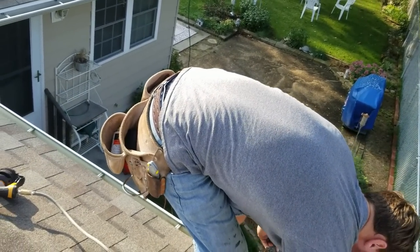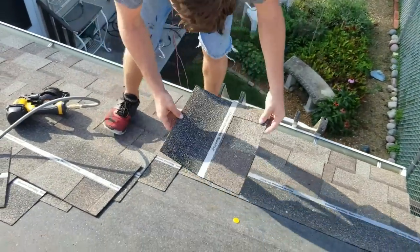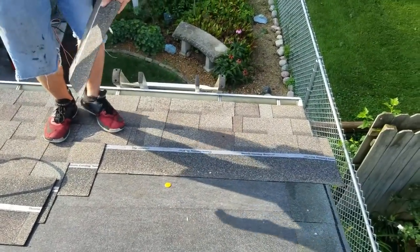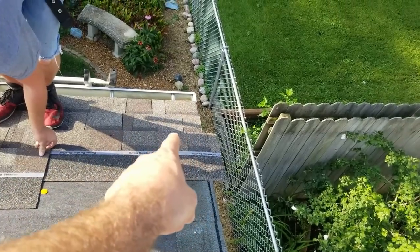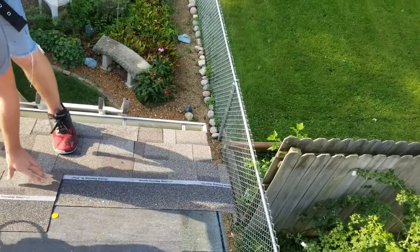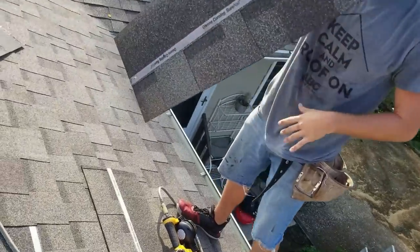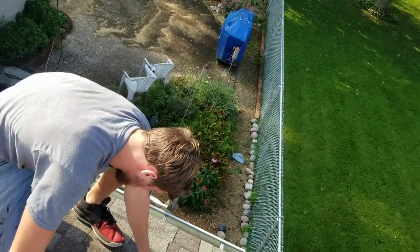Now when you do that back step there's a couple things you have to pay attention to — I'm gonna see if you get it. You missed one nail by the way, right there. Nicely done, son. I told him to cut his first one, if not first two, before he starts letting them overhang, that way he can see his starter mark when he does my little trick. Those nails are high — just put nails in a little different spot.